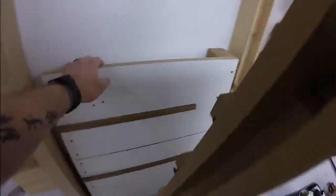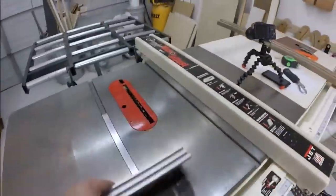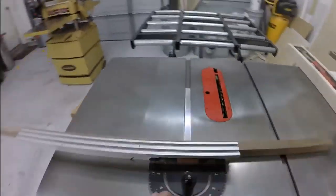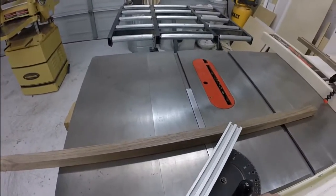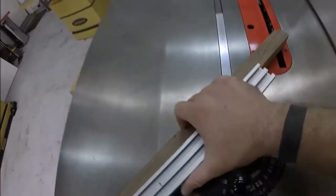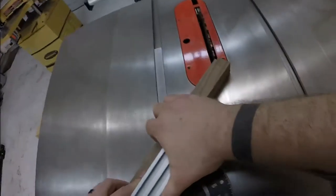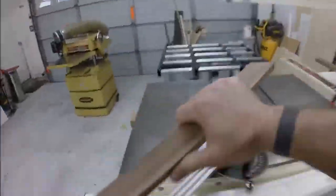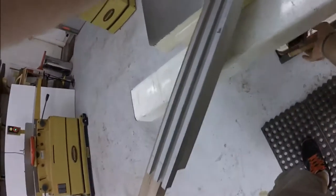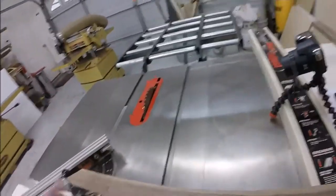With the lack of space in my garage, I'm forced to find other means to do things. I was looking for my crosscut sled for 45 degrees and realized I broke it a couple months ago. I first tried using the crosscut sled that comes with the table saw — they're okay, great for small pieces — but after trying a couple times to make the first initial 45, I realized I didn't like it. My hand was just a little too close to the blade for comfort. I ended up moving to the miter saw. There's a history of people in my woodworking shop cutting their fingers off, including my father, so I'm not in the mood for that since I work with my hands daily.